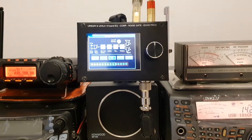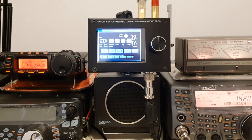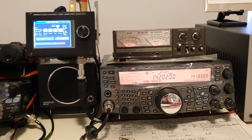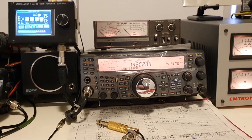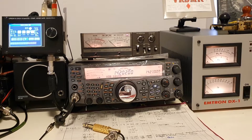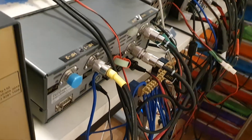Secondly, getting a lot of RF back in through the 10-band EQ, the UR6QW. Part of the fix which helped reduce it — which started to raise some issues in my own mind — was the amount of RF getting into it. There are ferrite chokes clipped on there, on this line and on the top line, and it almost stopped. I checked all of the lines — the lines are fine — I'm using RG213 on all of my jumper cables. As you can see, I've got them coming out, coming in, and then the radio itself.